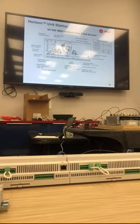Another reason we've done this is that we're seeing a lot of units on a site, say 10 of them. You set the gas pressure, you have 10 inches incoming, and you set your low fire at 0.4. Well, they're all outside air units, so typically they're all going to come on at the exact same time. When those all come on at once, gas pressure in the system drops, low fire drops, and you could have flame loss. So we're trying to prevent those issues also, because we're starting to see more and more of that. We're getting a lot more orders with more units.